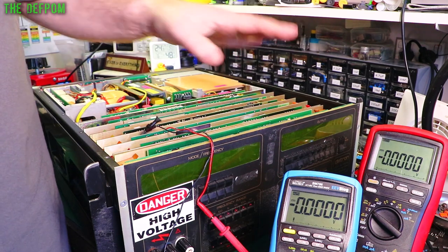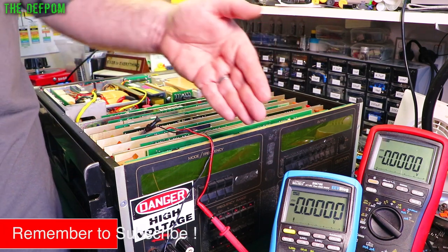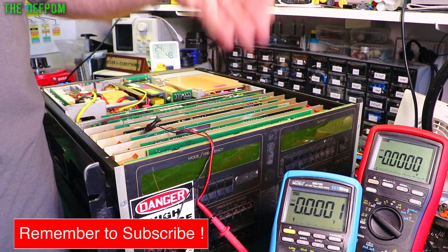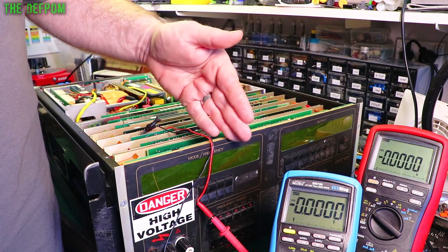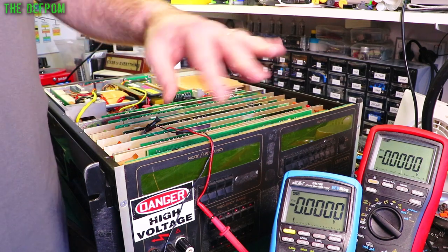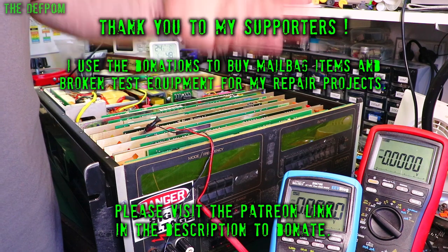So if I ignore that high voltage stuff for now, I'll just concentrate on getting the DC working, right? So let's look at the DC side and figure out what's going on with that, because that might resolve everything, because the DC is also used to help generate the AC stuff, they're used in conjunction. So I ignore the AC, ignore the high voltage, and come down to DC.